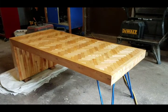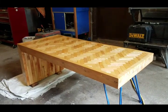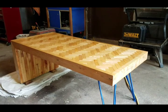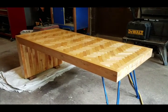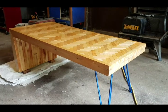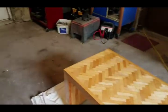And then once I had the trim on, I got to work on surfacing it. Did it with a belt sander with 80 grit. And then once I leveled everything mostly, I came in with 80 grit on a palm sander. And then I progressively worked up from 80 to 120 to 220, 320, 400, 600, and then 1200 by hand. And then I sprayed it with some Minwax.